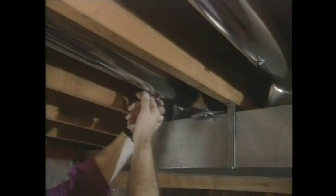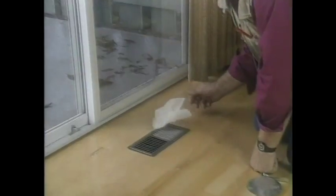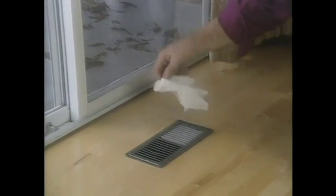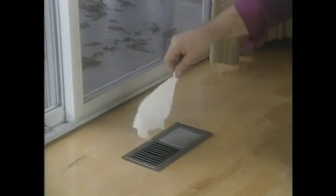To adjust the control, simply release the wing nut and then you can turn the control arm of the duct damper to control the amount of air flow. You can see there's all kinds of air flow there now — in fact, there's even more than what's necessary for the dining room.